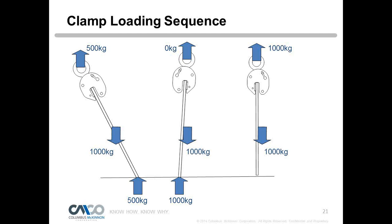That's a very good question. A misapplication would be to use that vertical clamp and stop there, and of course you see the zero loading, and if it's sitting down on another plate, it can walk itself off. If you're going to weld that plate in that position, it could walk itself off and injure somebody.